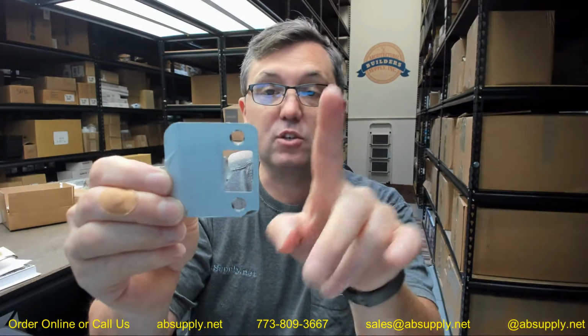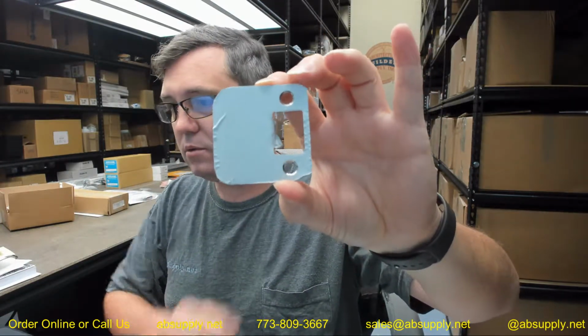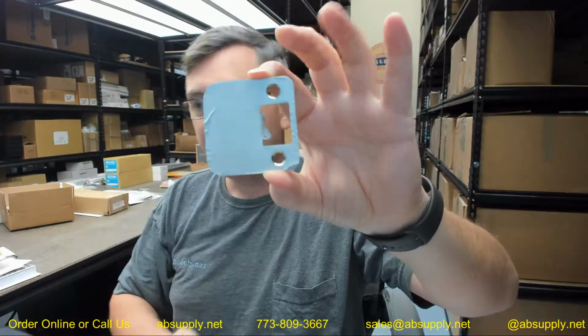That's a 1/4 inch radius, and that means on your wood frame, when they've taken the router, or whatever the machine is, however it's done, you've not gone back and squared the corners of that 1/2 inch router bit that's in your machine, your tool. And if you leave that, well, you'll have a radius corner, and a radius strike would be the way to go with that. Not a lot of people know that they could just, I suppose, square those corners out, because sometimes it's hard to get radius corner in the hardware that you want. But nonetheless, in a 1 3/4 D strike, or a full lip strike, you can get a radius corner.